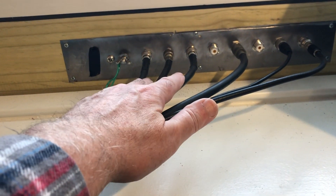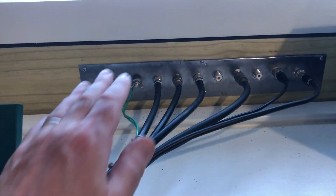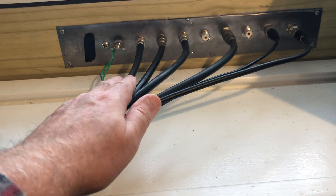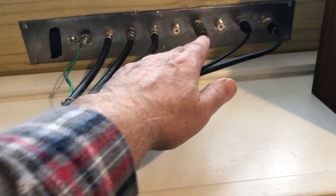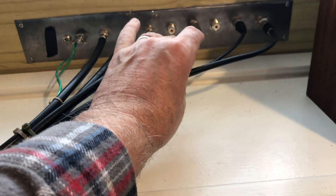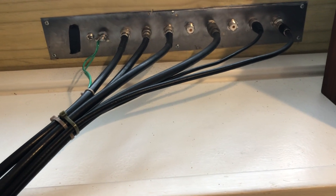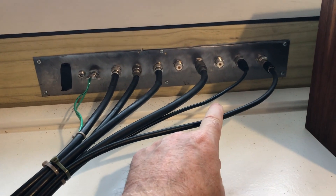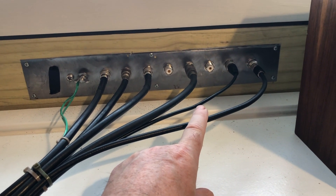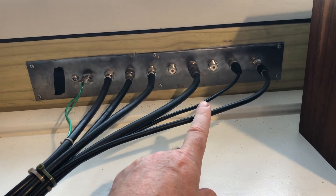I had RG8 jumpers and they're wired up to the antenna panel — the DMARC panel that I had made. The first three positions on here correspond to the first three positions here. Right now the only thing connected is the off-center fed dipole that you saw me string up in the last video. This connection here goes to the VHF UHF vertical. This is the cable that goes over to the 10 meter and 11 meter radio on the other side of the desk. And I have a little mag mount outside on a little L bracket mounted on the house — this is the weather radio scanner antenna feed.